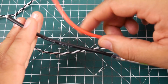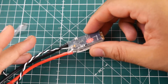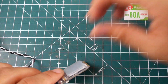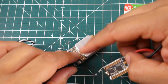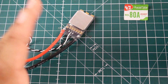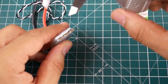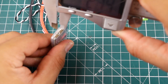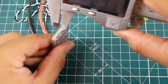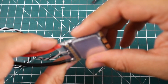They're using thicker gauge wire — 14 gauge ESC power wires. The board looks nice, and if you remove the sticker you can see some capacitors, but they're pretty big compared to other ones. Basically one cap on this ESC is as big as two caps on a typical ESC. The heat sink is about 2.3 to 2.4 millimeters thick, which means it's meant to take heat like a beast.